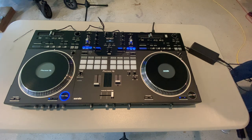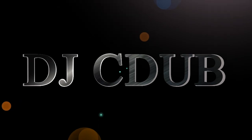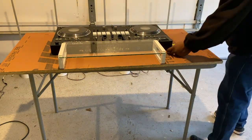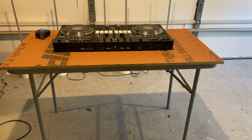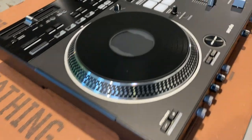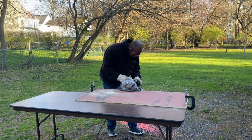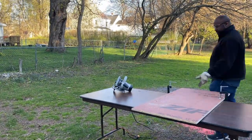This is a very exciting video. We're going to be building out the DDJ Rev 7 into the furniture. Now, when it comes to building this into DJ furniture, the first thing you want to do is find out how far you want to control it from your body. For me, this was about an inch from the bottom to my body and enough to put my tray for my laptop up top. Get it centered as best as you can, and then measure from each side the same amount of inches so you'll know that you have a perfect center based on where you want it to be. Once we've got the controller outline, all we have to do is cut it out, and then we'll start making some fine adjustments from there.